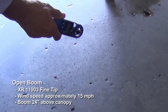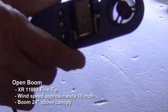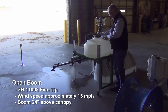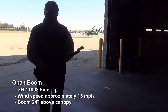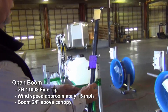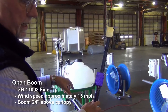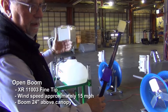We wanted to show you the wind speed right in front of the boom — right at 15.4 miles per hour. This is 10 feet downwind, basically 12 inches off the canopy and 24 inches, at 15 mile an hour wind, 40 PSI, with an XR tip. Now we'll go to the hooded side and do the same thing, then we'll compare results.